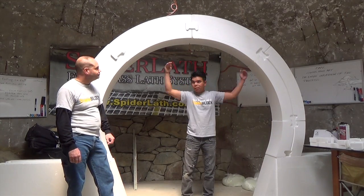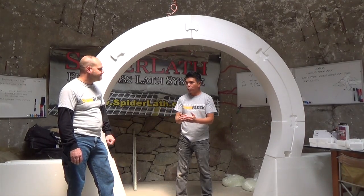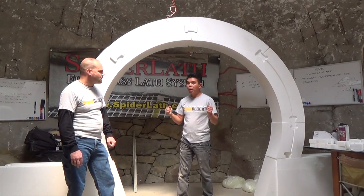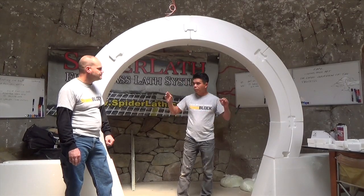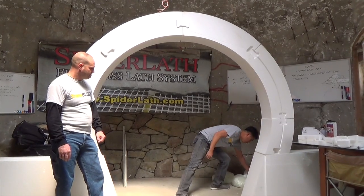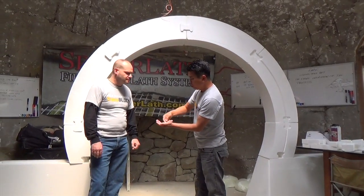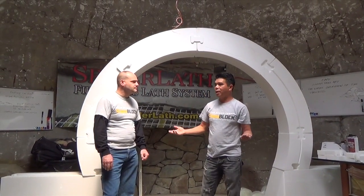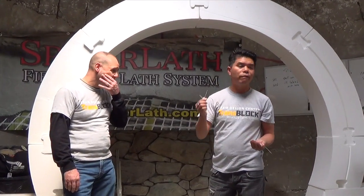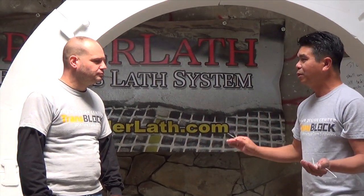The whole channel runs down. It doesn't matter where it is. It's gravity fed. And our mortar will be wet through plasticizer. So the mud is actually strong due to the plasticizer mix design with fiberglass fiber, and this is the key right here to make it strong. If we tried to tie this with rebar, the time spent on bending is ridiculous. This is the new technology that's going to make everything possible. Doesn't matter what shape, even an irregular shape, no problem.